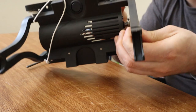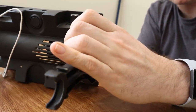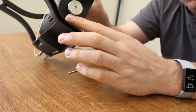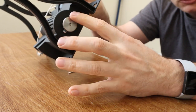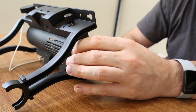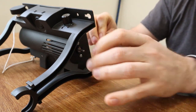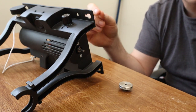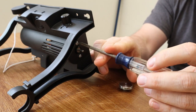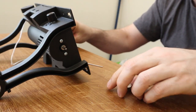The first rework is to change out the screws on the motor. The ones that shipped with it are five millimeters long and I want to change those to four millimeter long screws, which will prevent some damage to the motor. If the damage happens it'll happen pretty early on and I'll replace the motor. If you haven't seen it and you've been using yours for a while, it's probably not going to be an issue, but I will mention it.